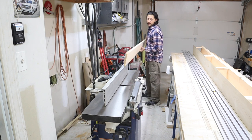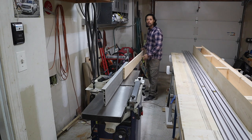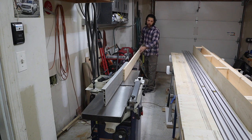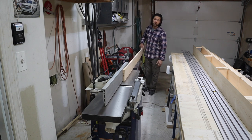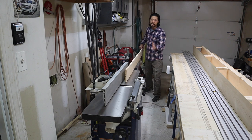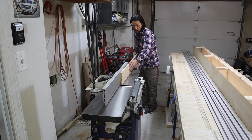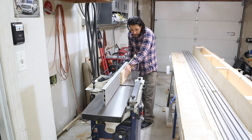This board is pine, it's very light. If it were oak or maple it would be much harder to control. When you try to join a long board you're holding it flat against the fence and flat against the infeed table, and it's tippy. You can set up an infeed roller, but in my experience rollers make the board wander — it's not controllable on either the infeed or outfeed side.